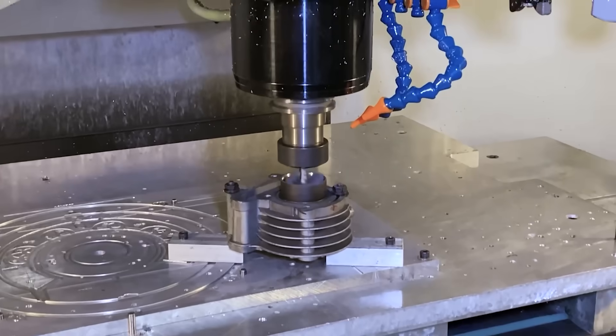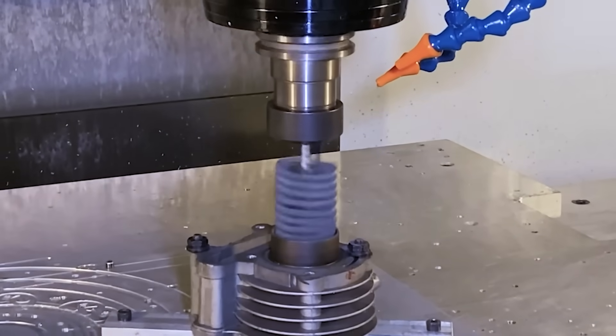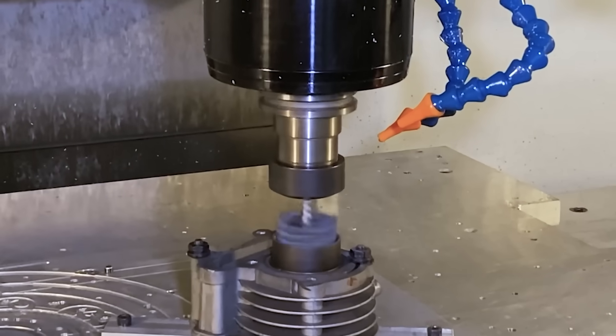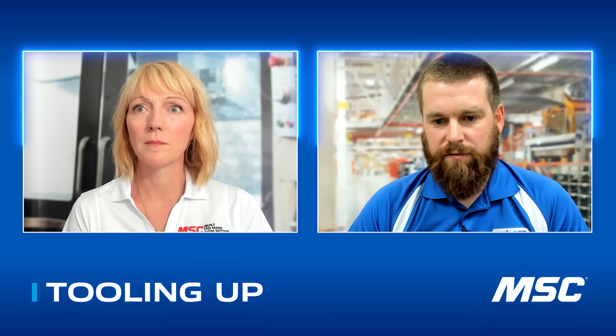Yes, that's the nice part about this tool. These are self-centering tools so they can be used manually and in an automated fashion. It ensures that you get an even finish across the entire cylinder wall. With the nylon filaments that are stiff but yet still flexible, it allows the brush to center inside the cylinder or hole and provide a precise, even finish all the way across the cylinder.